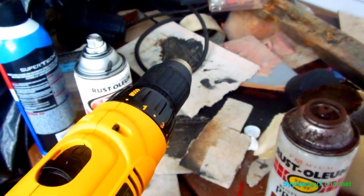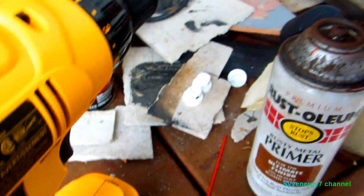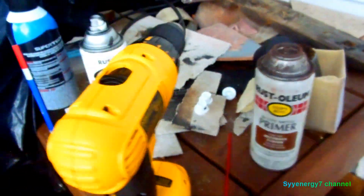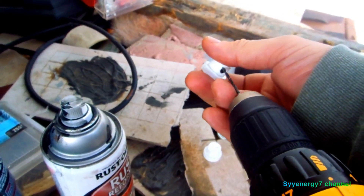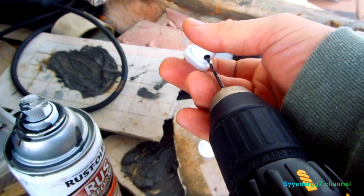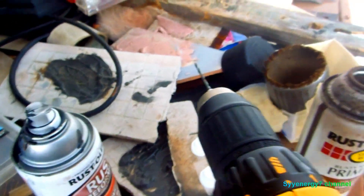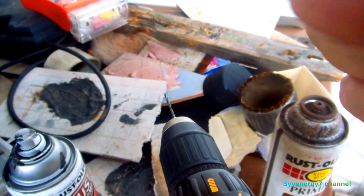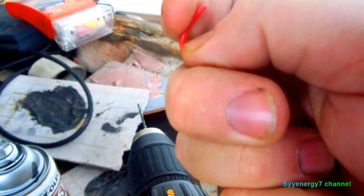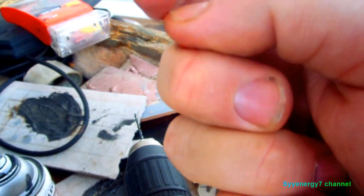We've got some brand new nozzles here. What I'm going to do is drill them out and put a wand on them. I'll take the drill bit, drill into here to open that up from the bottom, then put the wand on there. Then you can take the wand and put a 90-degree bend in it — you just kink it in different places, all at once 90 degrees, and just close it off.